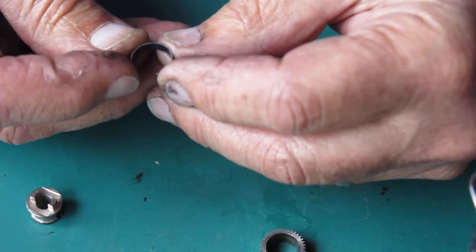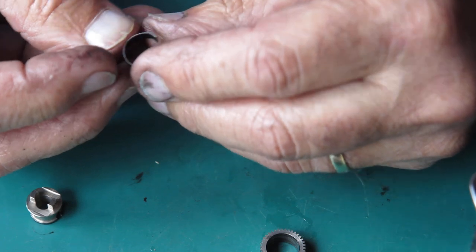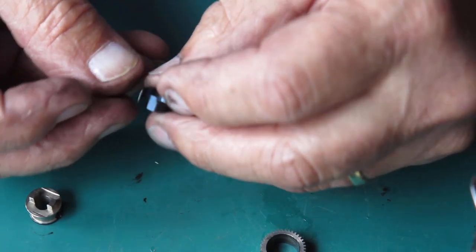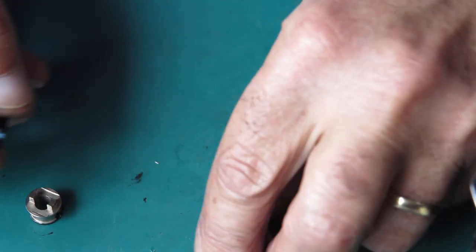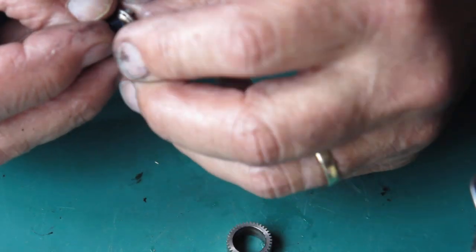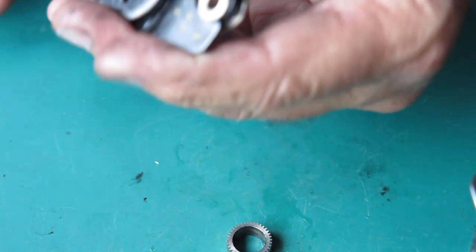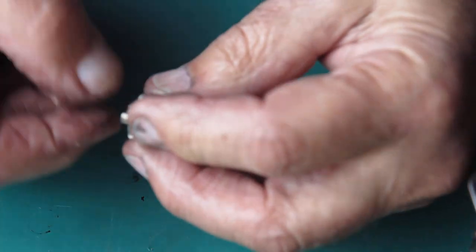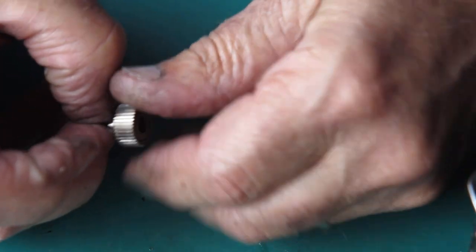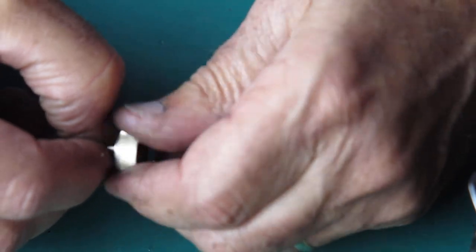I don't know if I can get it to relax slightly — perhaps I can. Yeah, it looks like someone's had a fight with this previously. If it's got too much tension it'll just be too stiff. That's better — it should have some controlled slippage; it shouldn't be tight, otherwise you're in danger of tearing sprocket holes out of the film.